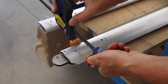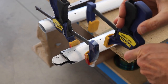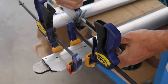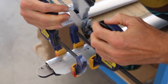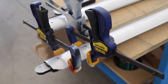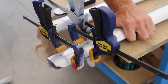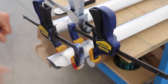All you have to do is put a couple of clamps on it this way, and it starts to squeeze the strut and open it up just a little bit. Coming around to this side of the camera — now I can start to move it. It's still tight but it lets me get it out, and obviously when you're squeezing it, it's opening the strut that way.